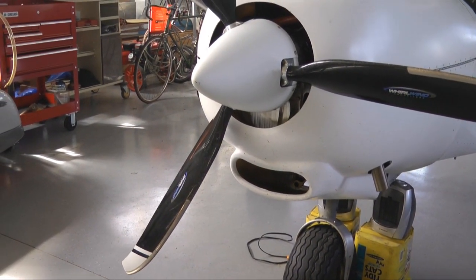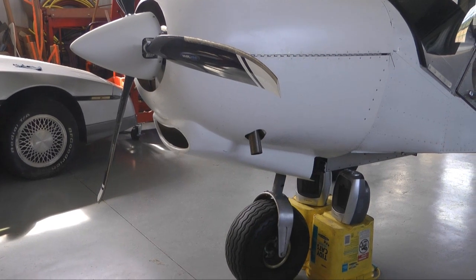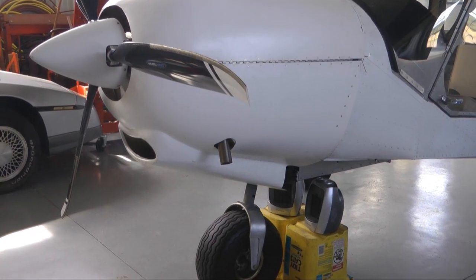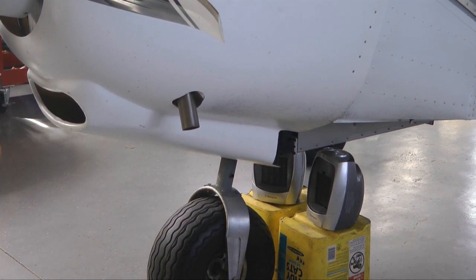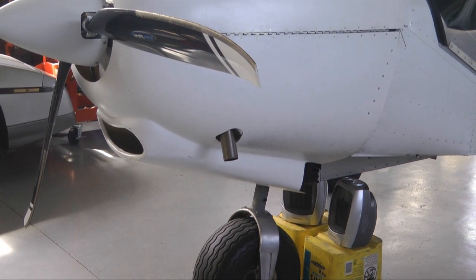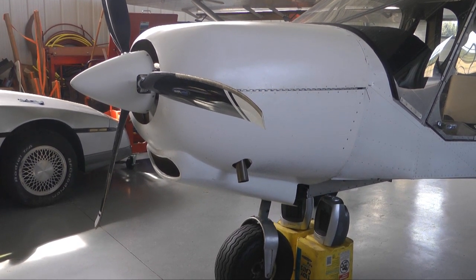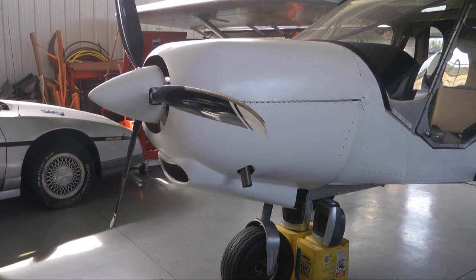Every cowl is a little bit different. There are some problems with this setup — it's rather inefficient to heat air and then try to get that hot air to actually heat the engine, and a lot of it kind of escapes. We could build some baffles around the heater to force all of the air into the bottom. If we used two heaters, that would be quite a bit of power, and we want to make sure we don't overload our circuits. This is better than nothing, though it takes an awful lot of heat and electricity to bring the engine up to a useful temperature.